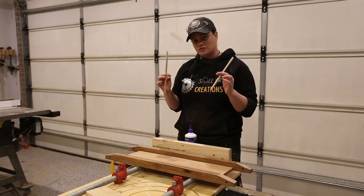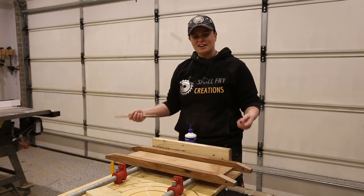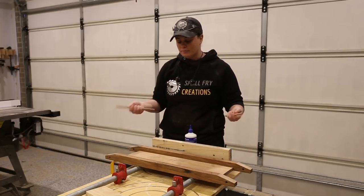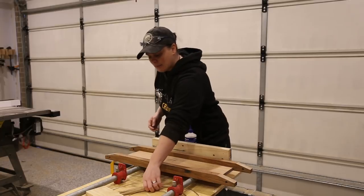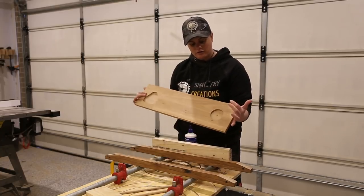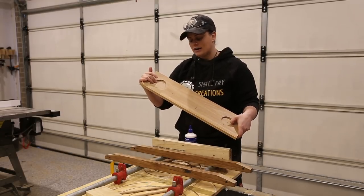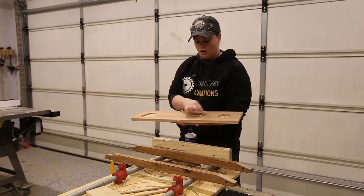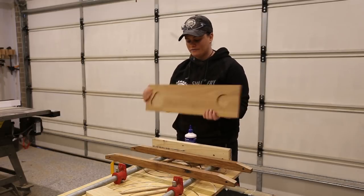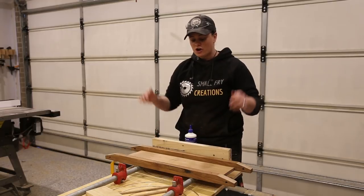You would have seen me cut two pieces of dowel. What I'm going to do is use these as handles on either side. I just think it's going to be a little bit easier to get it on and off the bath. That's what I think anyway. I'm going to glue everything upside down because I want my middle piece to come out flush with my two rails. I've got my hole drilled for my soft drink and also my hole routed out for my radio. I'll glue on the bit for the iPad after I've done this glue up. And then really we're up to sand and finish. So we are really almost at the end of this project.